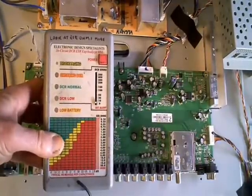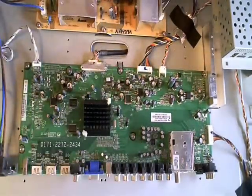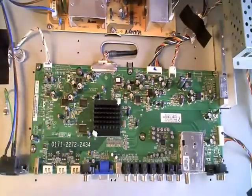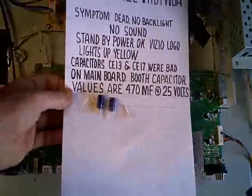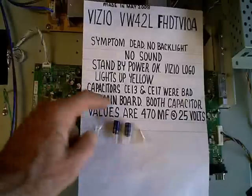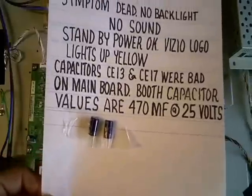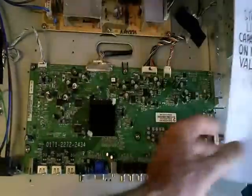So in this case, I had to unsolder them, even though I have this nice capacitor checker. That doesn't happen too often, but every once in a while you will have to unsolder one just to make sure — especially if you have two capacitors in parallel, that'll trick you. Another TV repaired. The location numbers were CE13 and CE17. Both were 470 microfarad at 25 volts.